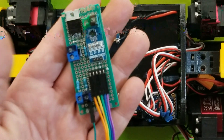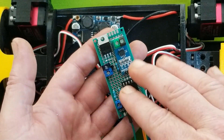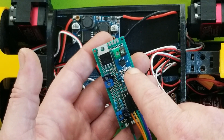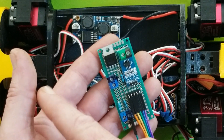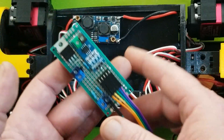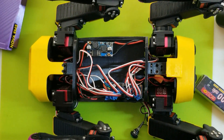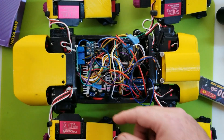I've also finished putting together the board for power management and control. There's nothing that will automatically shut things down if overloaded, but between a voltage meter, an amp/current sensor — the ACS something — and a circuit for a switch for the higher voltage, I can control the motors via software. I monitor the amperage draw and use a simple voltage divider to monitor the battery. This will get installed under here along with the battery.